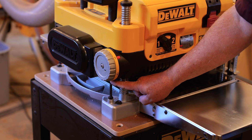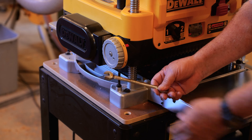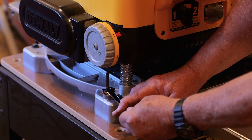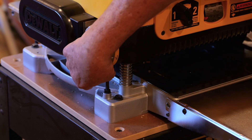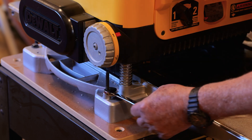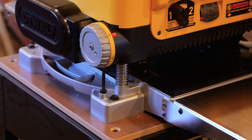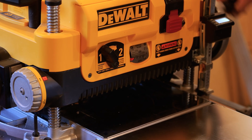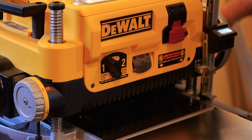Right now it's reading too high. So we're going to take a half-inch or about 12-millimeter wrench, put it on the nut, and just slightly loosen it a little bit. Now I can take this rod and turn it to shorten it just a little bit. There's a little bit of trial and error — I'll go ahead and set that. Now I'm going to turn this back on and descend the cutter head until it bumps the top of the turret rod.